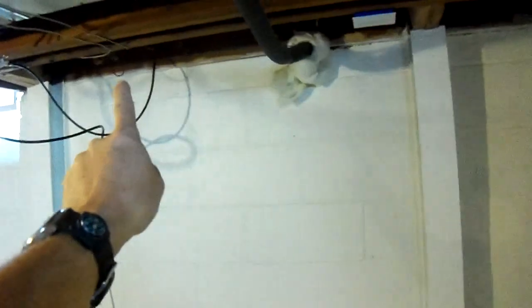He set the beams in the floor correctly — good four-inch steel I-beams, the right distance apart. He also put big steel plates here, because these joists run perpendicular to the wall while others run with the wall. Look at that. On this one he put some blocking in, though there's a gap — I would have blocked it back a little farther, six to eight feet. He's got a big steel plate on this one, and this one has nice big blocks in here.